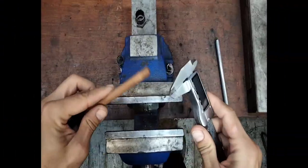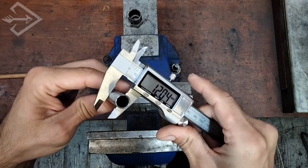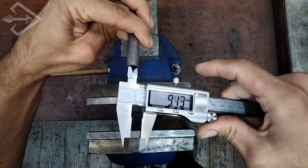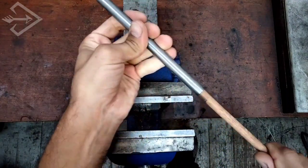I've tried PVC tubing, horse matting rubber, and all sorts of different things, and eventually those arrowheads always ended up breaking or splitting — until my most recent try. For the arrow shaft I use, which is around 10 millimeters in thickness, I chose metal tubing with a one millimeter wall thickness because we're going to be welding. The inner circumference has to approximate that of the shaft, so I go for a 10mm inner diameter tubing, and we want the shaft to fit very snugly into the tubing.